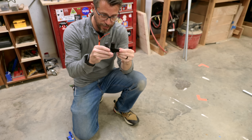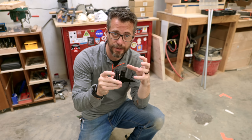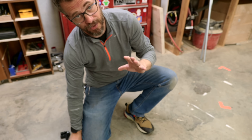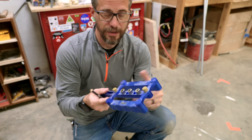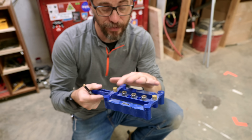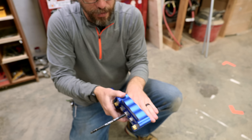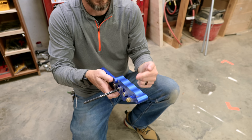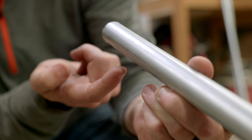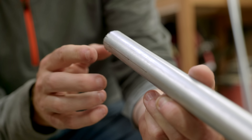Now I need to put on these hinges. To do this I have to drill holes through both pieces so that bolts can go through the pipe and through the hinge to lock it all together. I've been trying to figure out how to make sure I'm drilling the holes through the pipe on the correct plane, and I found a way using a center finder — a tool I bought for a totally different purpose, but it works. There are lots of different ways to make center finders, even out of scrap wood. I'm going to use one of the holes that fits a pencil, clamp it around the pipe, and when you squeeze it down it makes sure that this line with the pencil is at the center of whatever it's clamped around. Once I've got that I can drag it and make a mark on the pipe. Now I've got a line centered between both surfaces — I measure off the end, that's my point where I drill the hole, then I do the same thing on the other side and my hinges should be parallel.